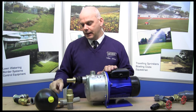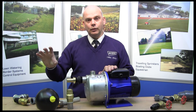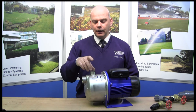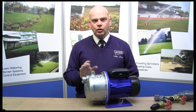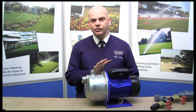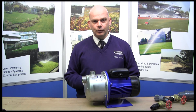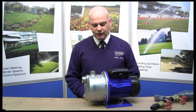It constantly moves up and down with the level of the water and maintains the best quality water for your pump. It also ensures that the pipe between there and the floating inlet is full of water all the time, so your pump won't go dry. Looking at the outlet fittings now — obviously this is the higher point of the pump. We're going to look at two options: first a normal traditional controller-start pump, and secondly a pressure system, a constant pressure system where it's under pressure all the time.